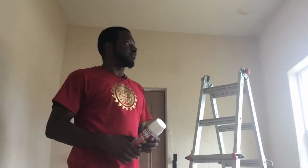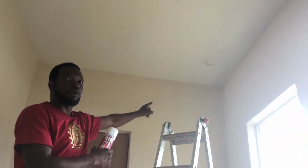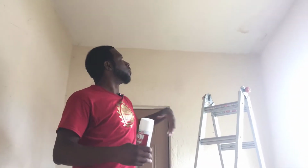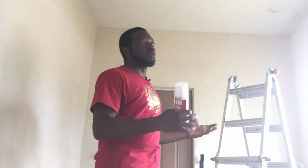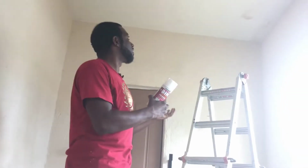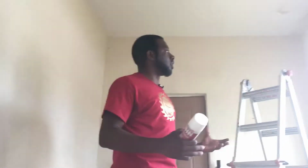Today's video, we're going to be fixing a water stain on the ceiling. Boom! Which is that, right? Now that happens when you have a roof leak and the wood and the minerals from the wood come seeping through the water and the ceiling, and it causes that yellow stain. So if you were to just try to paint over that, it wouldn't work. It'll bleed back through and it'll look like you didn't do anything to it. So this is how you permanently fix that yellow water stain.